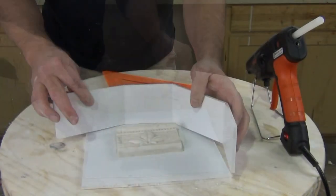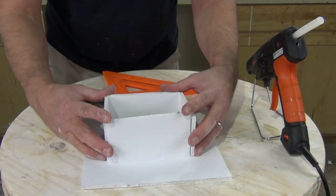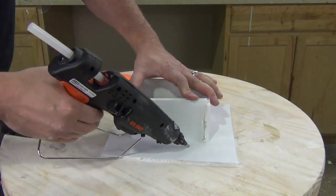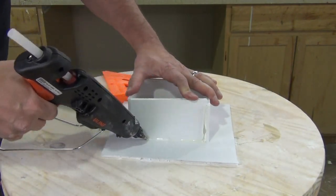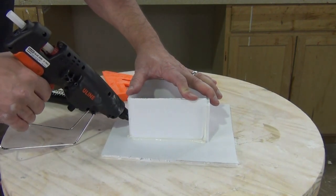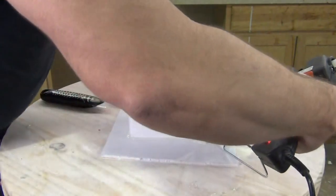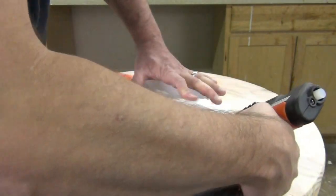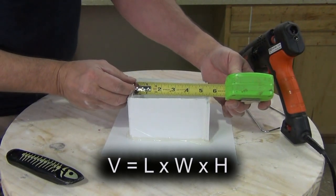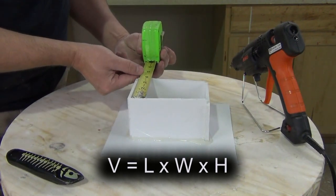It's also important to remember that factors like the size of the pattern can play into this. This is a small part and we can get away with a very soft mold, but for a large rectangular pattern it might be a good idea to go to a firmer rubber, because larger patterns could get out of alignment with something really soft like the 5110. Once we've constructed our mold box, we're ready to calculate volume and convert that into how many pounds or grams of silicone we need.